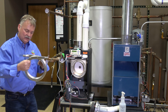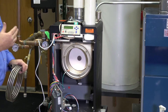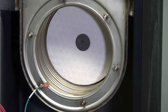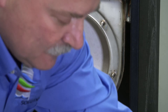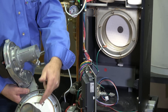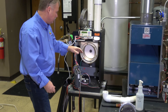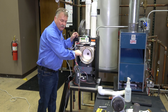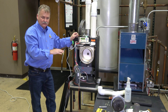These are where the water is inside here. Our combustion is inside here. In this boiler, this is 80,000 BTUs — we basically have three coils right in front. In the back, we have what's called the target wall. Basically, the burner sits all the way back up against this target wall, and this is where our flame comes out. If you see any indication on the target wall of discoloration — a brown line or something like that — start looking at your condensate drain. That means something is backing up.